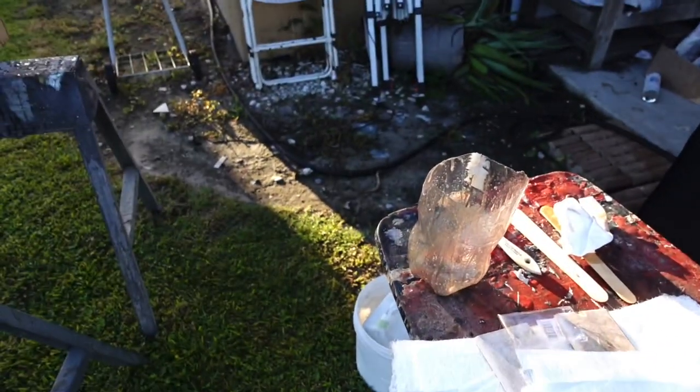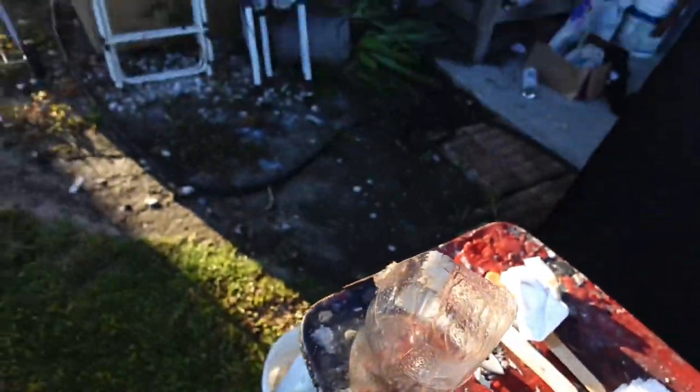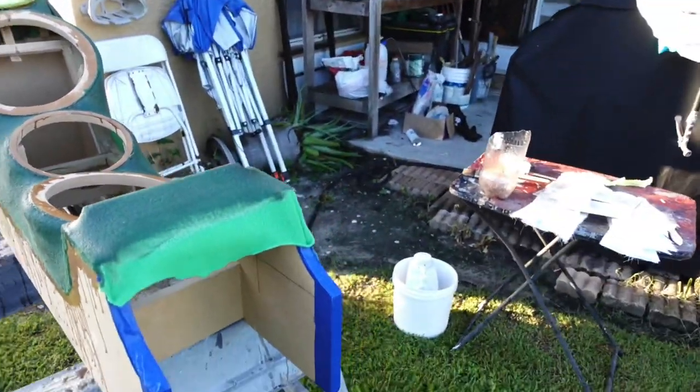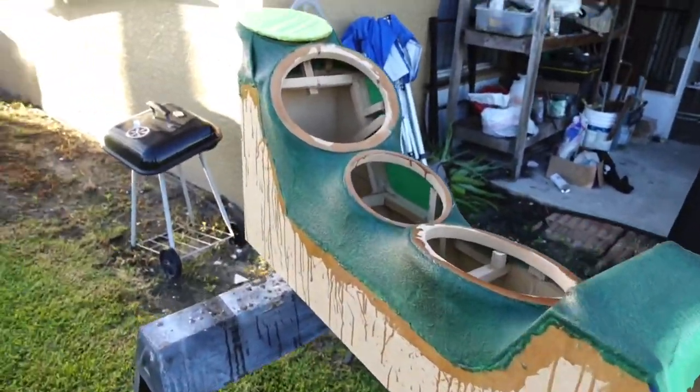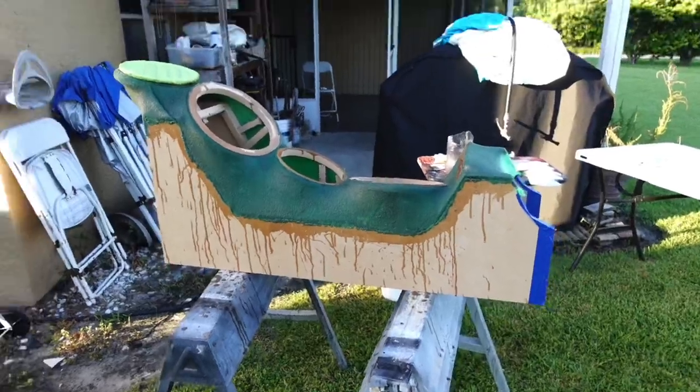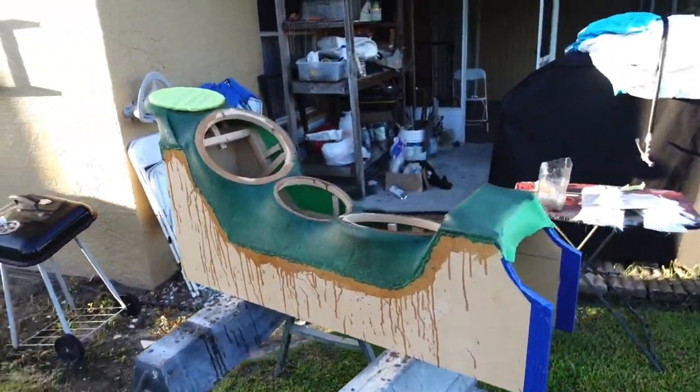So while our little bucket that we got going on today is somewhat still fresh and wet, we're going to continue and put fiberglass resin in again, mix the MEKP up nice and dark brown. And then we're going to get back on it and lay this fiberglass mat. You guys get the gist of it real quick, right?